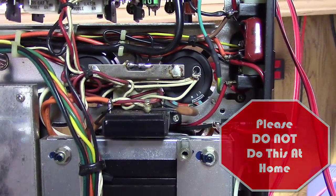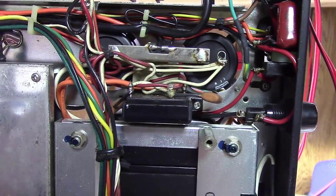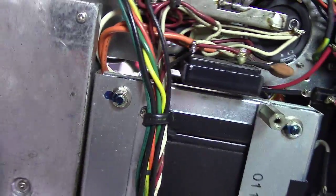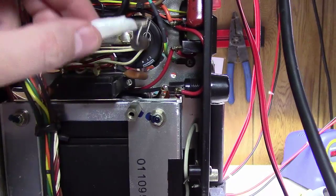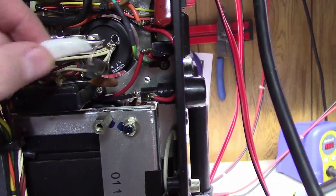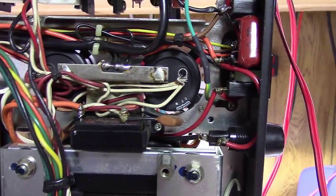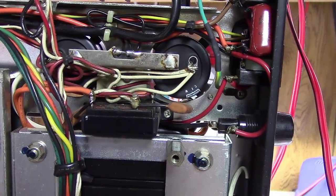But my point was, typically you should do that by getting a 100 ohm resistor, connected in series with a test lead. I do it quite frequently, but connect one end to the ground here, which is common in the middle, and then you use the other end on the other side of the resistor to actually touch the capacitor, and it lets it bleed off slowly. What I did was a fast discharge. It's not really good for the capacitor, caused a big surge of current there, but as you could see, made quite the sparks here. The reason I did that was to make a point.